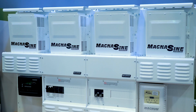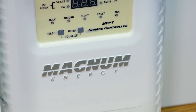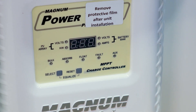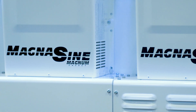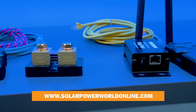Using our CC-CV profile, you can charge most any lithium-type batteries. That CC-CV profile is fully configurable as far as voltage set points, maximum charge current, end-on time, and end-on current. We also have the standard profiles found on all Magnum products, which include lead acid, flooded, AGM, gel, etc.